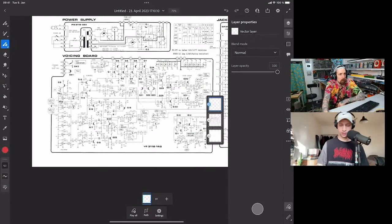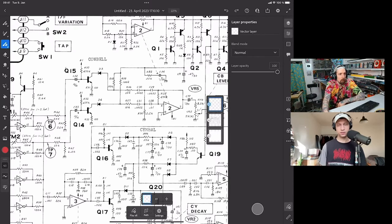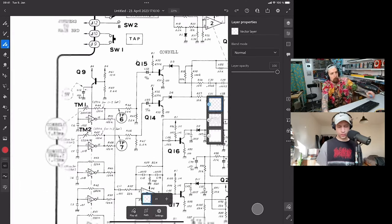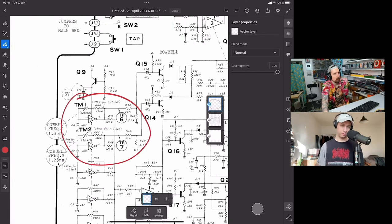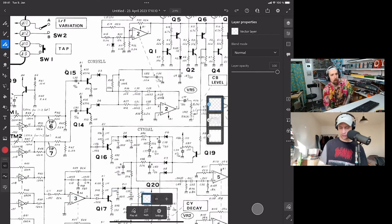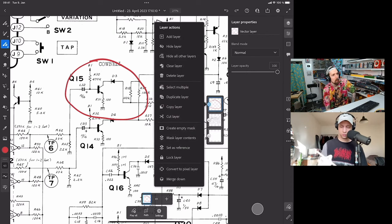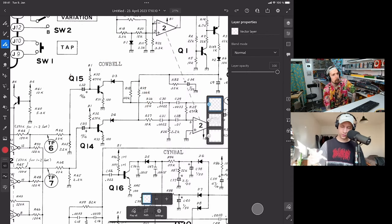we took a good long look at the schematics for the cowbell in the 808 service manual, and we basically got this stuff set up, because this wasn't so hard. These are just two oscillators tuned to two different pitches, that are then combined at some point. They are combined via these two things here, which are VCAs. Kind of shitty VCAs, we established that, but they are VCAs. The issue was with these VCAs, because Simon set one up, I set one up, and nothing really worked.